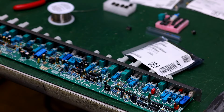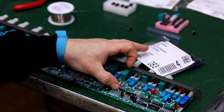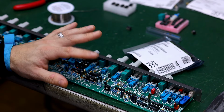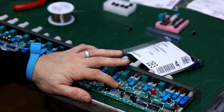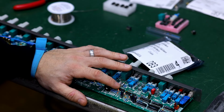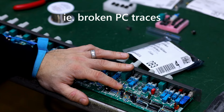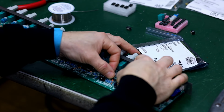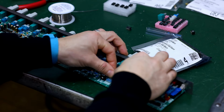Now this is a very dangerous thing to be doing here, and I can tell you from experience that I screwed up a few of these to figure out the best ways to deal with it. But basically, we do not want to directly try to desolder this thing, because that has a high failure rate. So I'm just going to try to break it by flexing back and forth gently until the metal gives out.